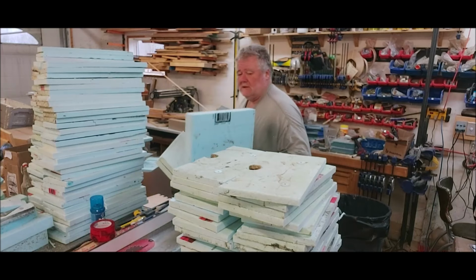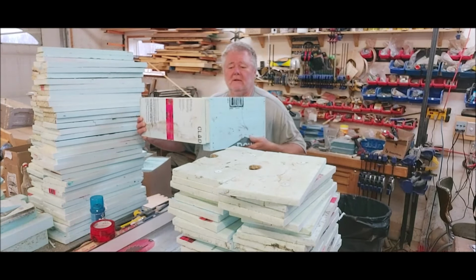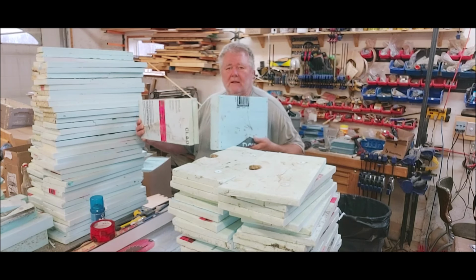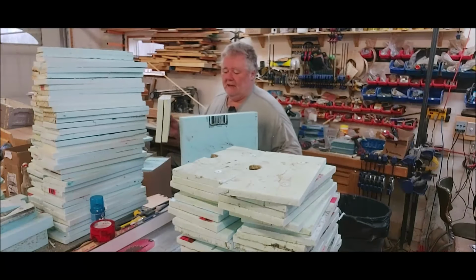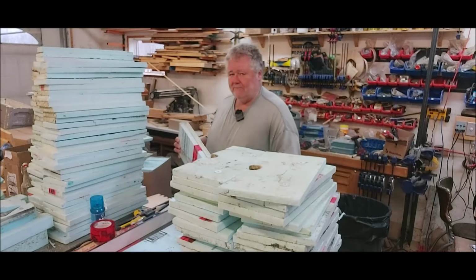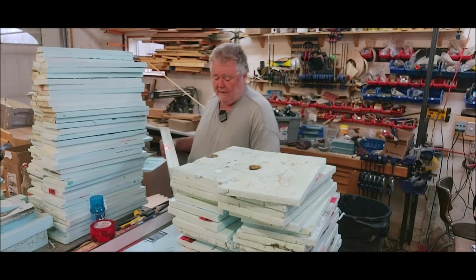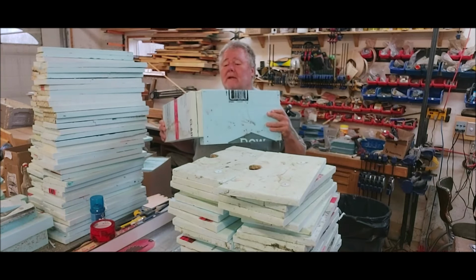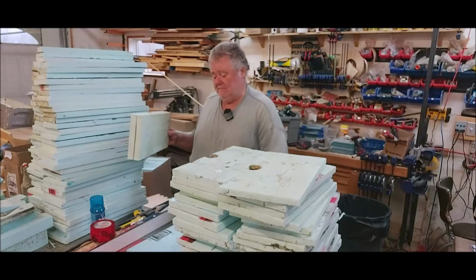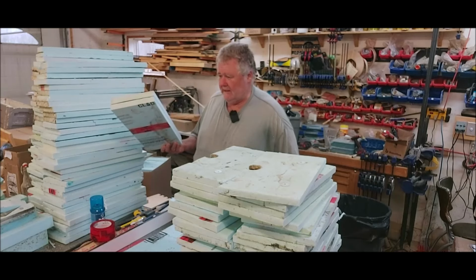So if this is a back, I want the side to overlap like that. I don't just want to leave that corner like that. So I have to have the 20 and an eighth plus 2 plus 2. That's 24 and an eighth. The eighth won't matter, really. So say 24, easy. That's what I'm trying to make out of these.